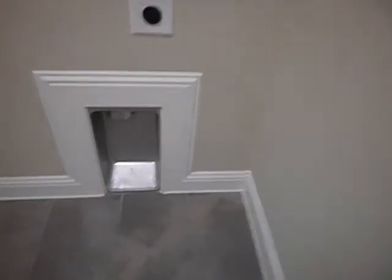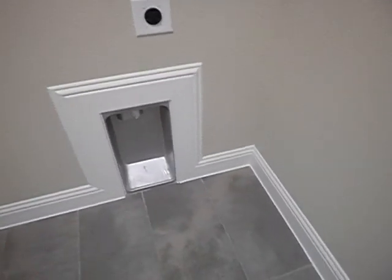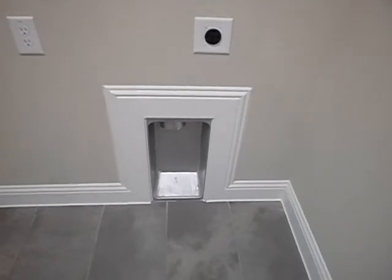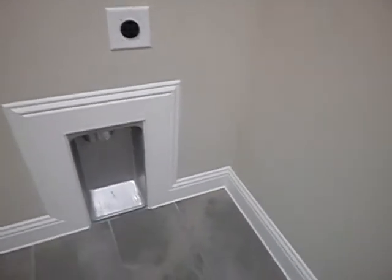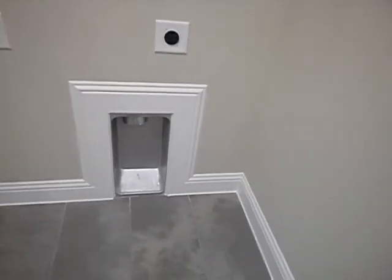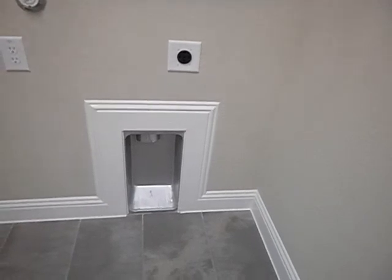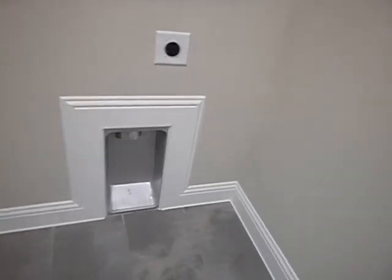This is a clothes dryer vent. It's supposed to have a label on it. The label tells you how big it is and how long it goes, so that when you buy laundry equipment, you can purchase equipment strong enough to work well with this vent pipe. If you've got an underpowered clothes dryer, for example, it might not exhaust like it should.